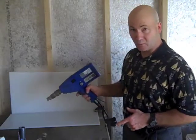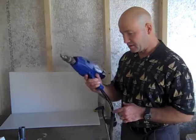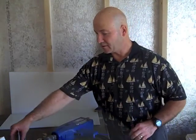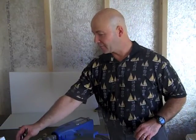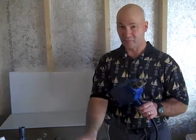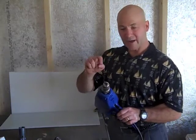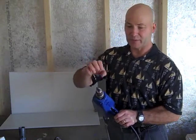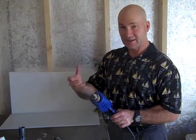For my 90-degree weld, which I'm going to do today, I've got a fillet weld tip on here. This unit comes with several other tips, including a repair tip, a bullnose tip, and some other fillet weld tips. Changing those tips requires taking this off — that's where I've got my thermal gloves on. A lot of times you have to wait until it's heated to change the tip, because the plastic solidifies in there and makes it harder to change until it's heated up.